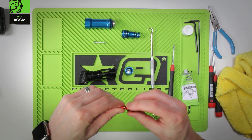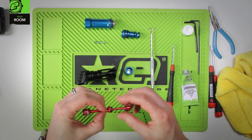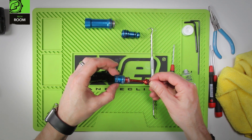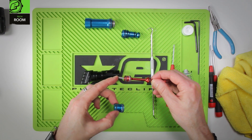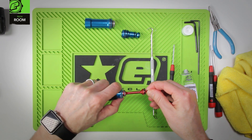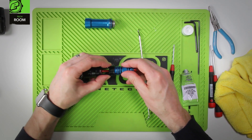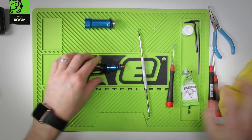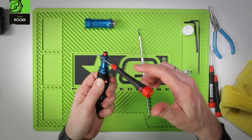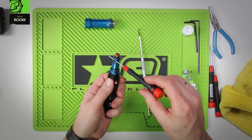Apply some grease to the spool seals, then we can actually assemble these — slide them all in together. We have the switch, followed by the spring guide, then the spring, and then the spool. Slide all those in, then slide on and screw in the bolt guide. We can place a hex key through the holes and gently work this into place. We need to make sure there's no gap — it's very important that we go metal to metal on these two components. This keeps everything aligned and straight.